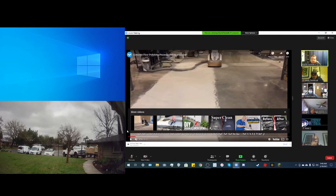There are two different processes of doing this. You can do it with dry grinding or now a process of wet grinding. There are other videos that will show the wet grinding process. It doesn't matter whether you do dry or wet. I will say this, though. The material that is being cut has to be sucked up with a specialty vacuum cleaner because the material that is being exposed, that dust, is a known carcinogen.